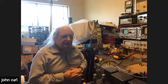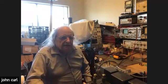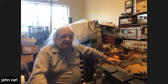Only under research, like let's say you want to measure a resistor or a capacitor, a single component, then that extra 100 times sensitivity can really bring something out that would not be brought out. But for a whole amplifier, generally speaking, it doesn't make any difference. You go much below minus 100 here, and 100 is already below what you can hear when listening. You're never going to hear it. The noise in the room will just cover it.